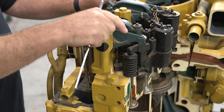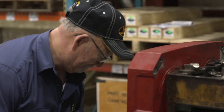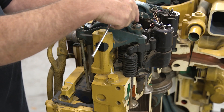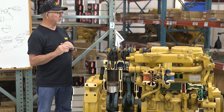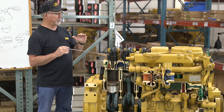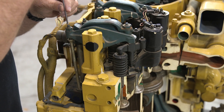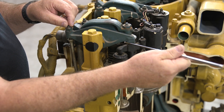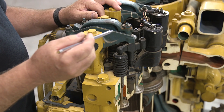If you go through and make the adjustment on the valve train, you'll need to bar or rotate the engine to set it in a specific orientation. The adjustment is made when the valves are closed and the rocker arm is furthest away from the crosshead. The adjustment is made by loosening a lock nut, turning an adjustment screw, checking it with a feeler blade, and then locking down the lock nut.